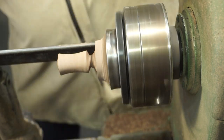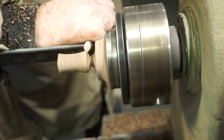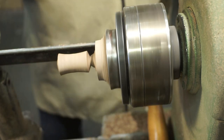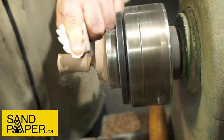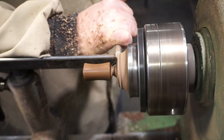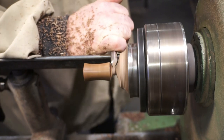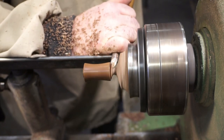Yeah, so I'm using a tool called a skew gouge. I bought it from Lee Valley Tools here in Canada. There's actually a link in the description if you want to get one. But it does a good job getting into those little tight areas. There's no flutes, so it's just a flat grind. And then, of course, the sharp tip. It works well.